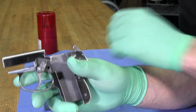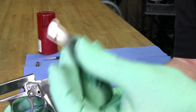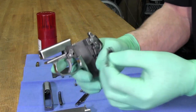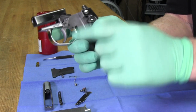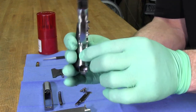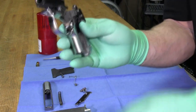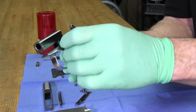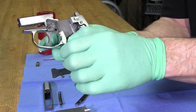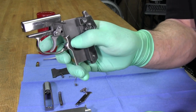It had nothing to do with the grip screw being too tight, which of course presses on the side plate and the draw plate — nothing to do with that at all. It was actually the trigger. I wasn't looking down there, and it was accidental when I looked down and saw some scraping. I took the trigger off, looked at it, and saw it was making contact down there. Then I started looking down there and could see exactly what was happening right away. Now, even though the trigger is still moving side to side, it doesn't matter anymore because it's no longer hitting the guard, thanks to what I took off the trigger.